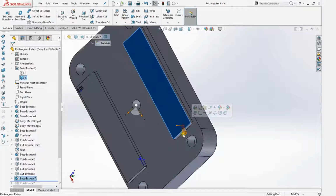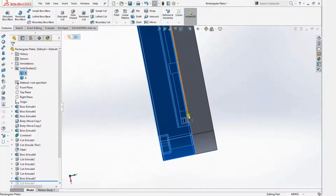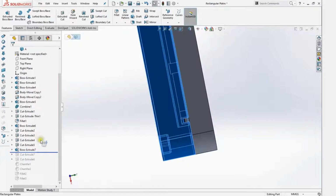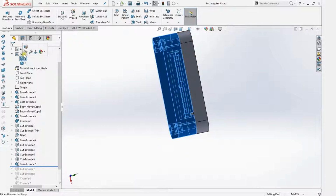If you make this exactly the same as the hole you wanna put it into, then it might be difficult. So make it 0.004, something like that, smaller offset, and then it should work really well. Okay, but let's remove this again.